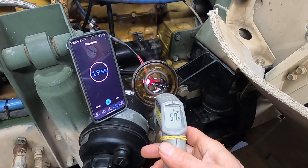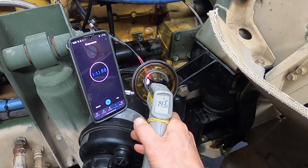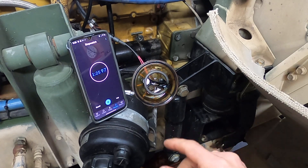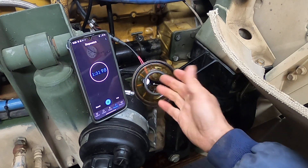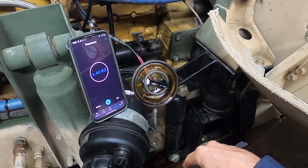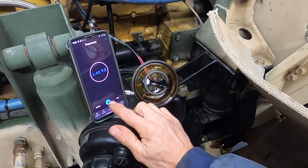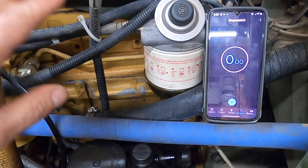I'm going to turn the switch off because there's no way it's going to heat that switch up with air in between it and the heating element. I'm going to stick it back on the fuel water separator, get some fuel in there, and then we'll see how long it takes to warm up the fuel.